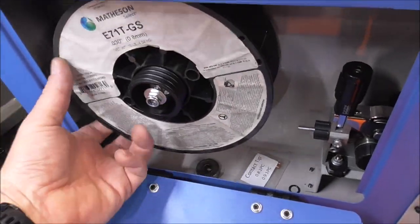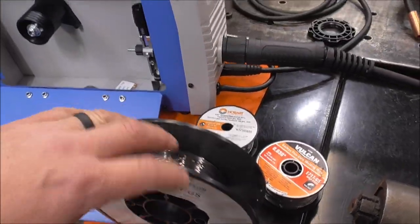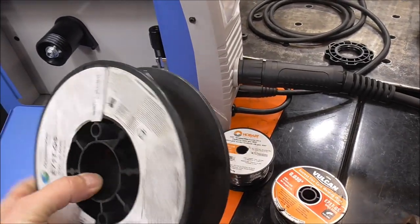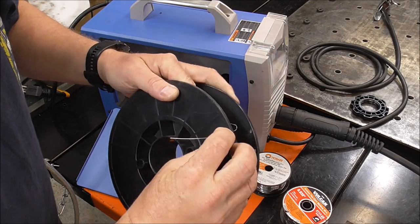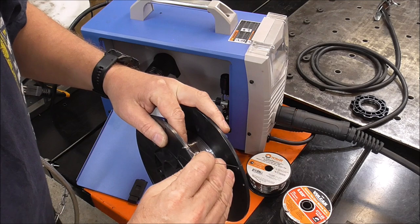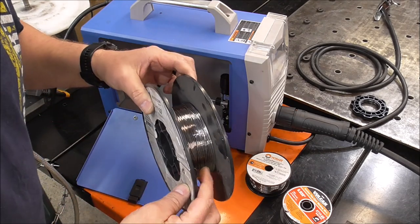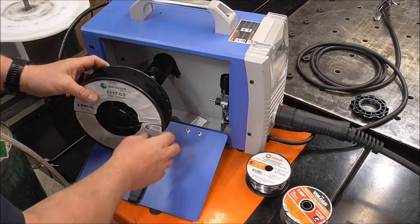Well, now you can't get to it. So prep the wire beforehand before you get it on the machine, because you don't want all this wire coming off inside the cabinet as you're trying to get everything together — it still happens to me occasionally and it's a pain to get back on the reel. If your wire is coming through the back and you need to grab it from the front, just switch it around. Take it from the back of the reel and stick it through to the front so the wire can't come off and make a huge mess.